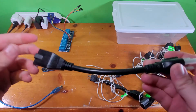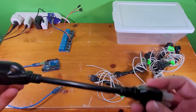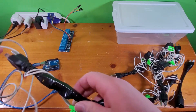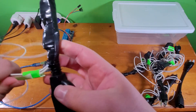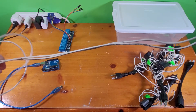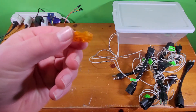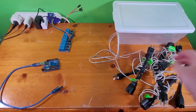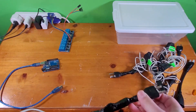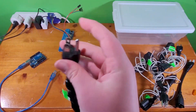We bought 1-foot extension cords off Amazon — if I was to redo this I'd probably buy something a little longer. What we did was cut the 1-foot extension cords, pull out the white wire on the inside for each side, strip it, add extra wire from Home Depot, and hook the wires together with connectors also from Home Depot. Then we took the two wire ends and put them into the relay, then plugged the cord into a surge protector.